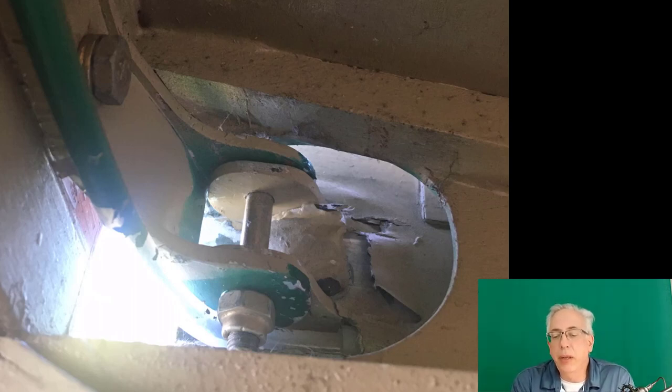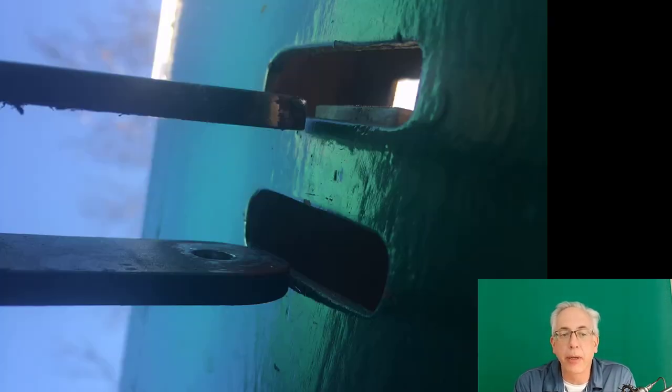But I just wanted to say that this is a common problem in the design, in that if you don't have enough clearance in the airfoil shaped section of the upper cabin where the brackets protrude into the cabin and onto the spar carry through, then you won't be able to make that arc around and get into the holes properly. And so it looks like the rear hinge mechanism might be bent because of the attach brackets not being aligned with the holes.